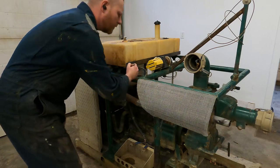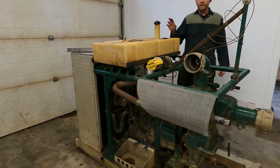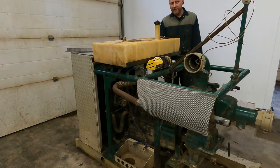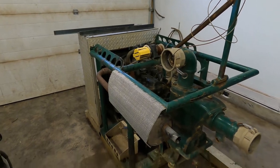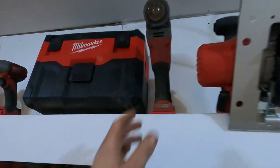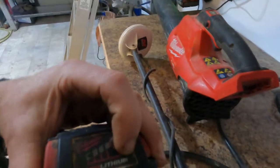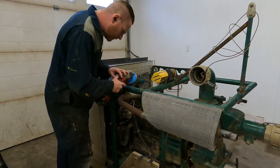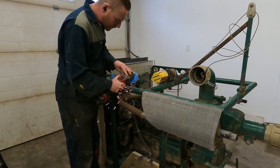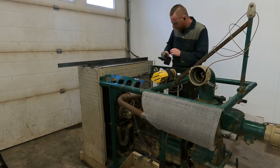Let's mark these brackets where they're supposed to go, we'll take that fuel tank off and get these things tacked on. This fuel tank has some real stinky gas in it — I need to drain it out and flush it, just so it's made for diesel now. Now let's get the grinder out and take some paint off so we can weld properly. Safety glasses first. You'll notice in my videos I'm always using cordless Milwaukee tools. I personally don't have a preference between the competing brands, but Milwaukee has more options. On a mine site, cordless tools are a must — hauling a generator and extension cords around is a good way to waste time.